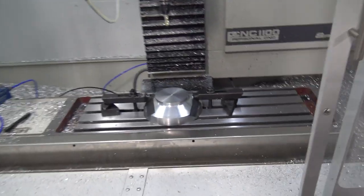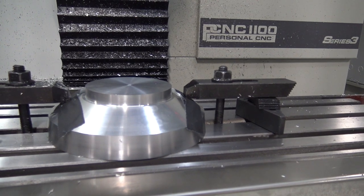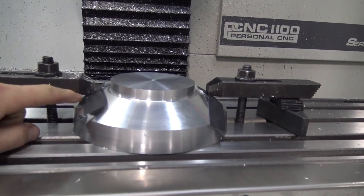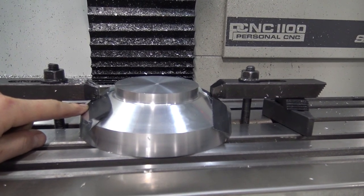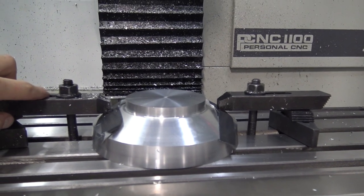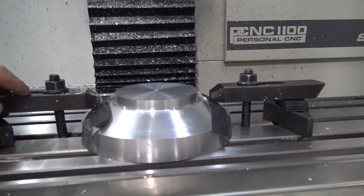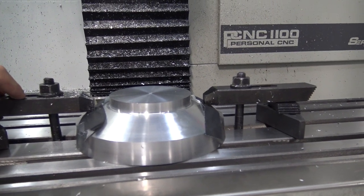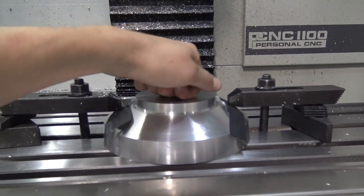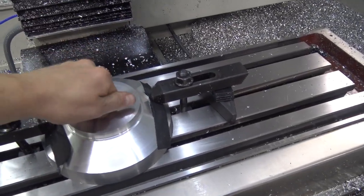And the idea is that aluminum helps me strap down with this strap clamp, but obviously not mark or deform the finished surface here. I put a piece of gaffer tape under the aluminum as well. And when I tightened these down, I felt how tight I could get them, because I knew if they slipped or if I wasn't able to get tight enough, then this wasn't going to work. I think, knock on aluminum, it's going to work. And this is one telltale sign, that's solid.